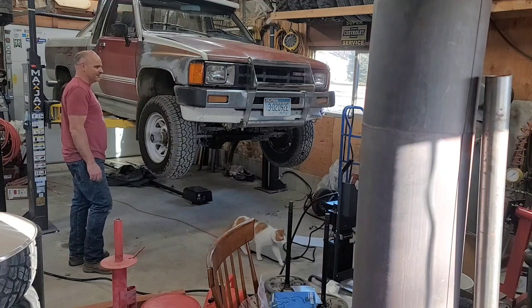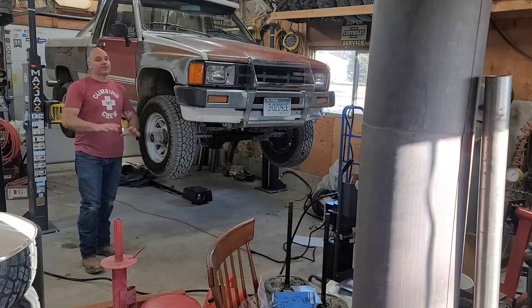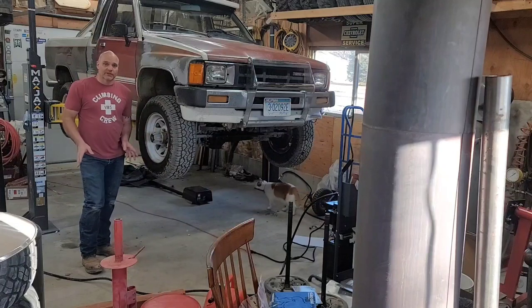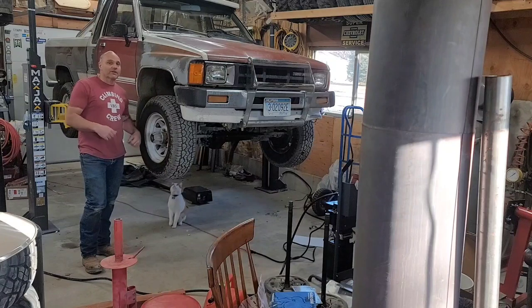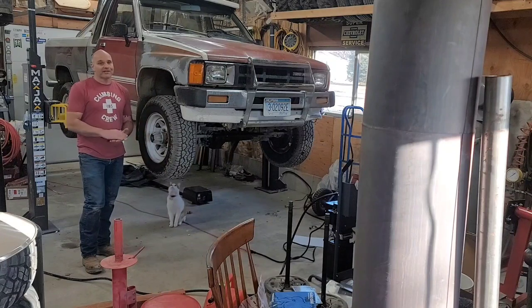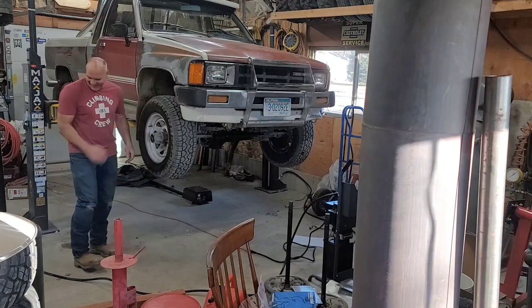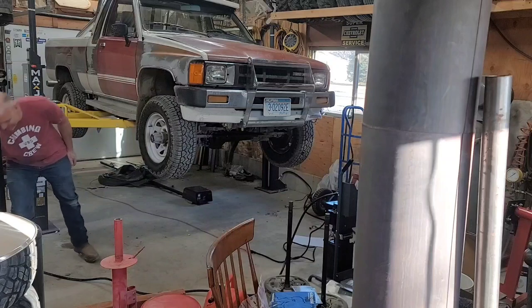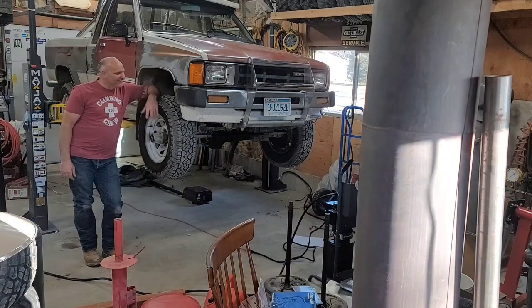Yes. All right. Well, if you've been thinking about one of these, get it. Just do it. Really simple install. I wish it only took as long as it does in this video. Simple install, basic tools. Concrete has to be at least 4 inches thick. Mine was 5 inches thick. You got to go down 5 inches for the anchors to sit correctly. But all in all, really straightforward, simple install.